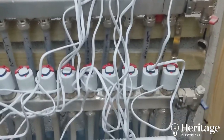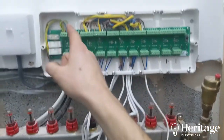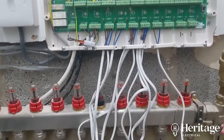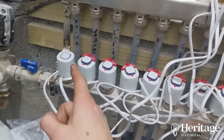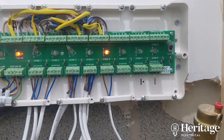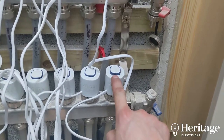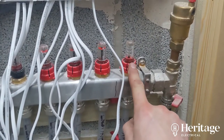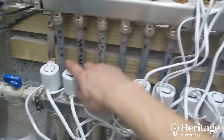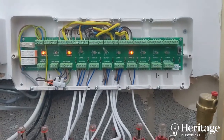And there we go - no wonder the house is always boiling. When any zone calls for heat, all of these loops are open, so it's been heating the whole of the downstairs. There are a few things to sort out here - we need to either swap these actuators around into the right slots, or swap the thermostat inputs to correspond with the relevant outputs. But let's take all these actuator retainers out first. So our erroneous zone five is calling for heating - you can see that actuator is standing proud, here's your flow rate, and all of the others are now closed off.